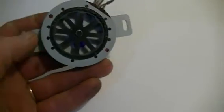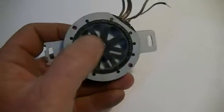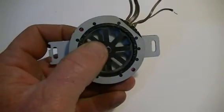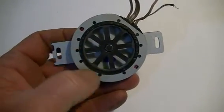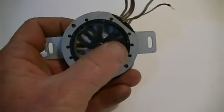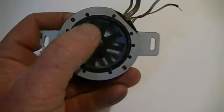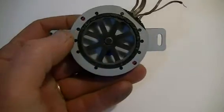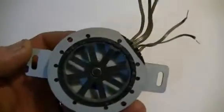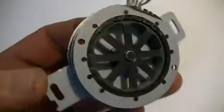It's time to have a look at this stepper motor that we were looking at in the last video. The thing I found interesting with this one was the way that the stator coils are wound. I've never seen a motor with stator coils wound like this before, because the stator coils on this motor are actually wound around the rotor.